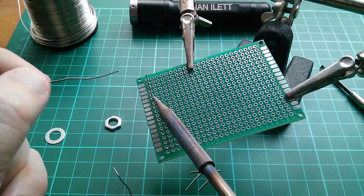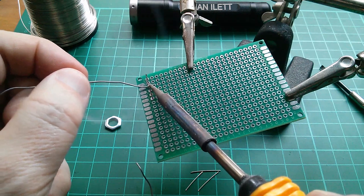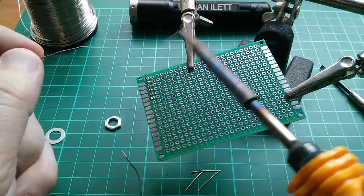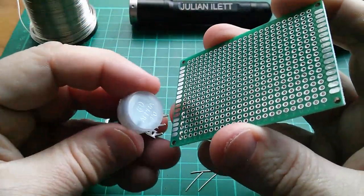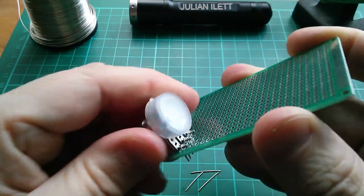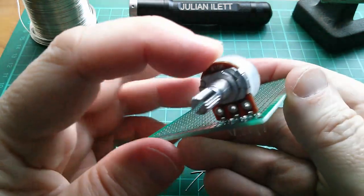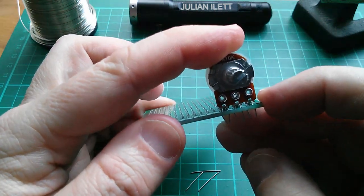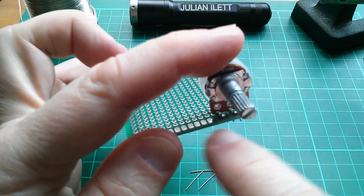Because these are through plated holes it's really a one-hit process — you don't get much of an opportunity to redo these, or at least it's difficult to redo them. All right, that's soldered. Let's see if the pot legs slip under those little links. So these pot legs have to slip under the little loops and yeah that feels pretty good — that's a nice tight fit. Then I'll solder those on and possibly solder the fronts here where the bits of copper coming off the pot are sitting just above these edge connectors.